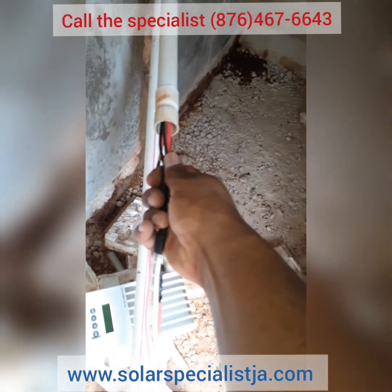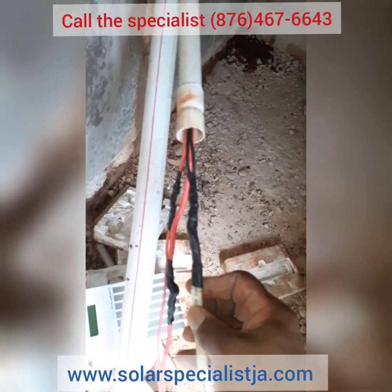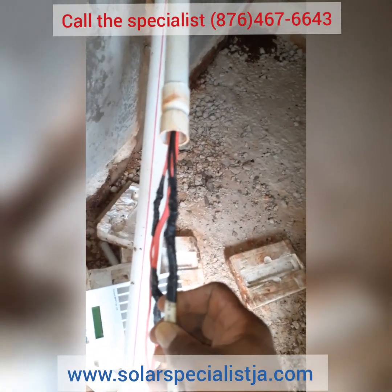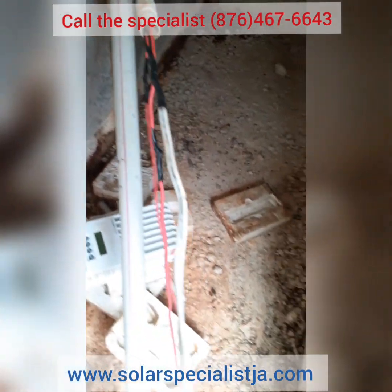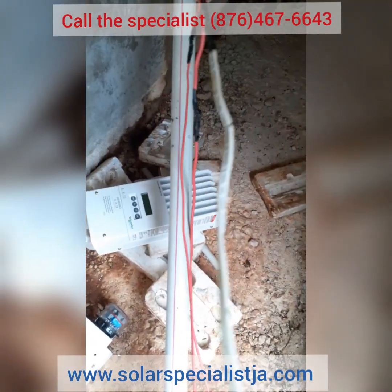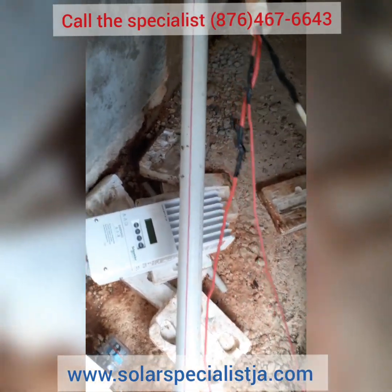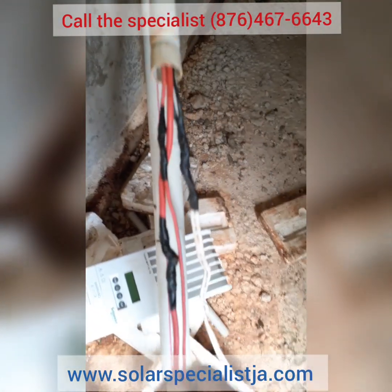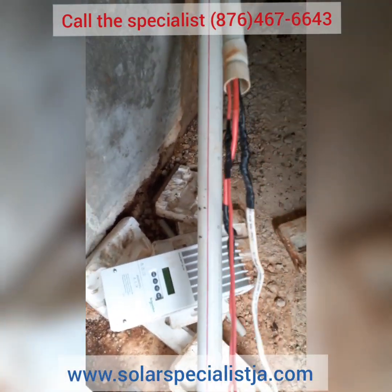As you can see, this was spliced and hidden in the pipe. They spliced the line, made a connection, and taped it back — using again the wrong type of wire. This is 2.5mm sheathed AC wire. The entire thing was wired with AC wire: 10mm AC wire and 2.5mm AC wire.